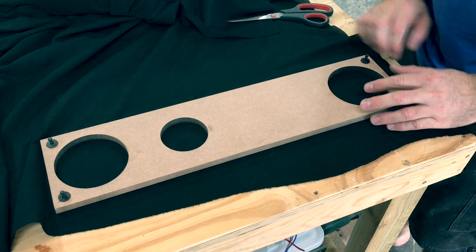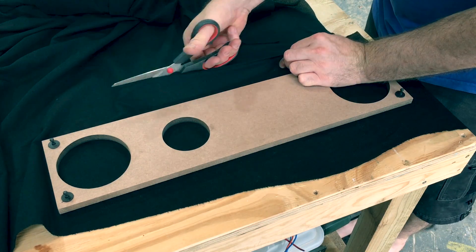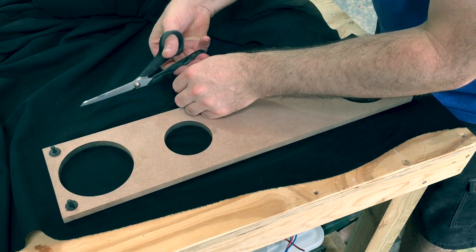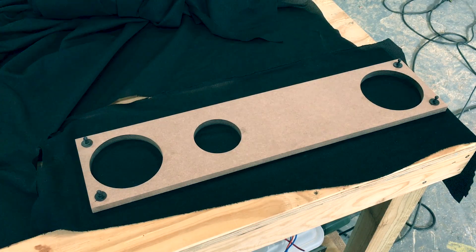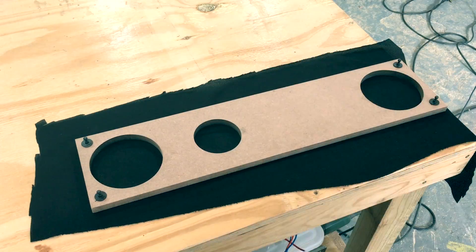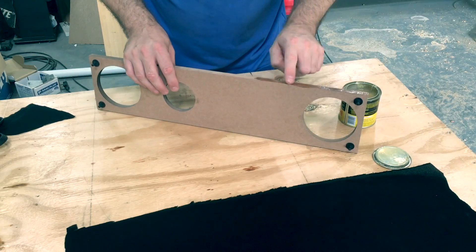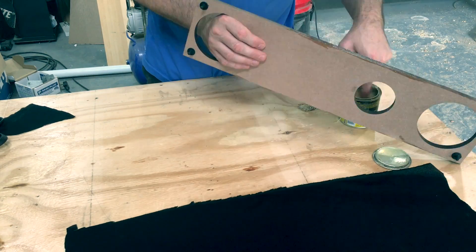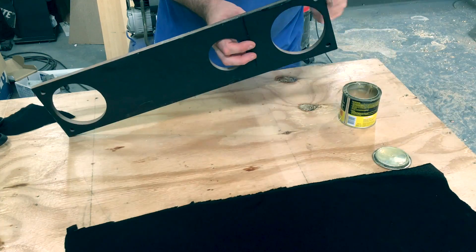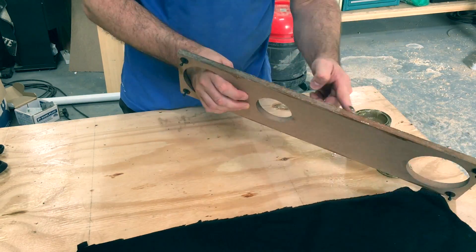In this phase I'm doing some of the detail work. The speaker grill gets covered in a crystalline transparent black cloth. Contact adhesive is applied to the sides of the MDF grill and it's left to dry until it just gets tacky to the touch.